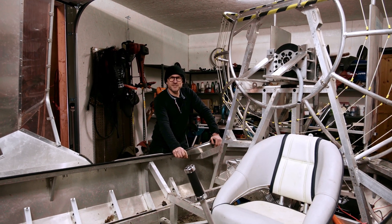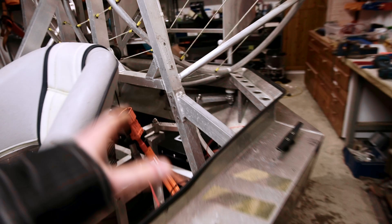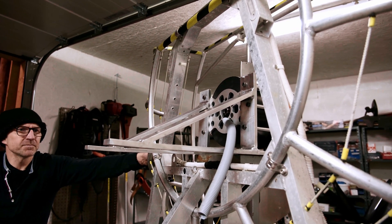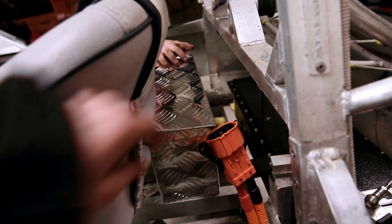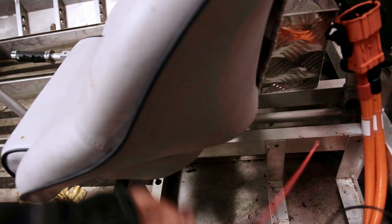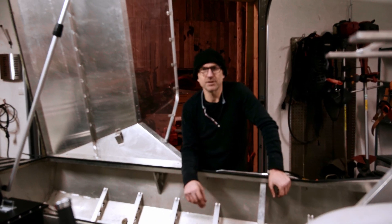That's day one done. We've decided where the batteries are going to go — one battery here, one battery in the back — it's to do with weight distribution. The motor mount is going to be modified, and we're going to put flat pieces of metal that go up and bolt to the top of the frame. ESCs and controllers will go down here behind the seat with the cables coming up under the seat. The displays will be over in that area by the driver so they can just switch them on. Then 12 volt from the displays feeds into the original 12 volt system, which comes straight out of the batteries, so everything goes off the one system.